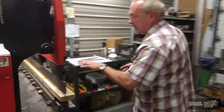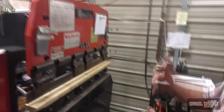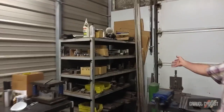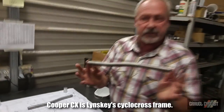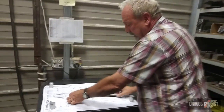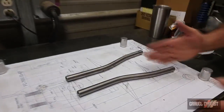Over here is a press machine — this is where we do a lot of the bending of the tubes. We bend tubes two ways: either with a bending machine or with a press die. Here would be a press die, and here's where some of the dies are stored. Here are some of the end results. As an example, this is for a Cooper CX — this began life as a straight tube. It was put under here with a die, comes down, hits it, and the operator puts it up against the drawing as a quality assurance check to confirm the bends are correct.